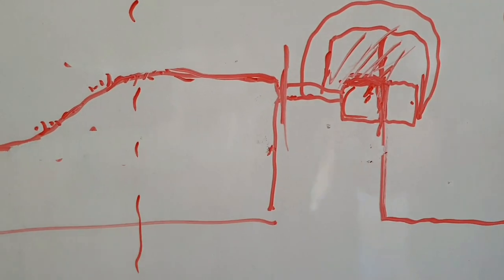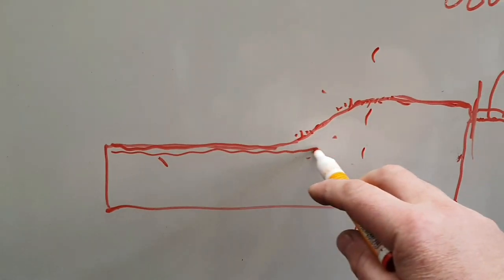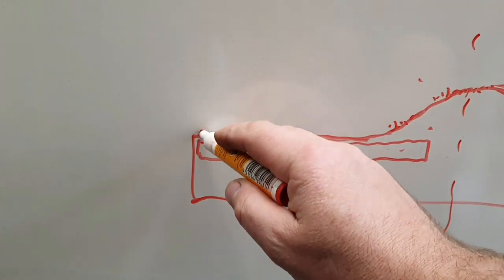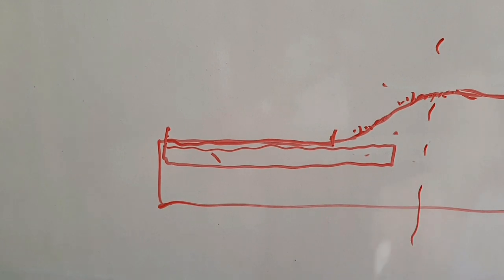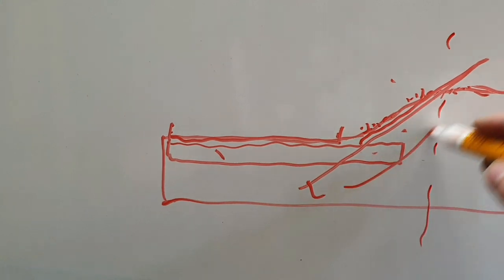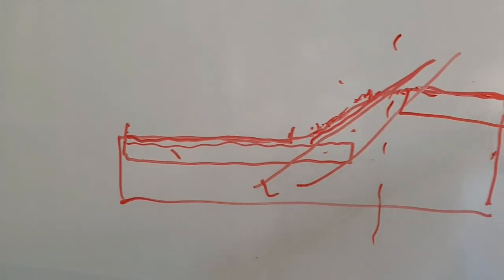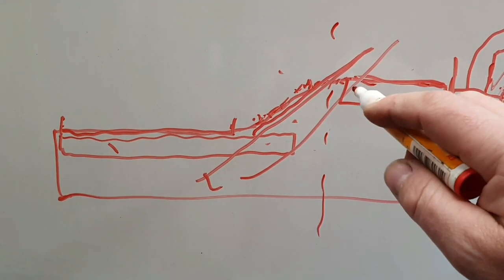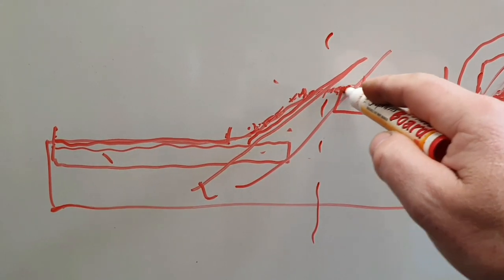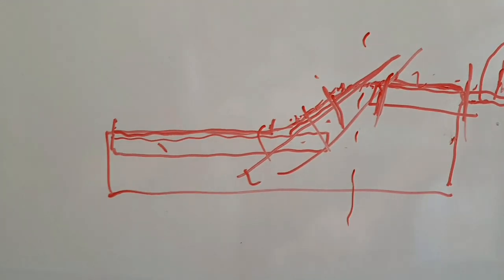This piece here becomes a dolly and away you go. You can do that for the entire length. A piece of bar like that on either side — that's that section done, piece of cake. You can do the next piece by putting a bar right on the other side, do this bit, and then do the end piece the same deal. These bits in the middle that are curved — hammer and dolly, easy.